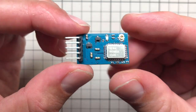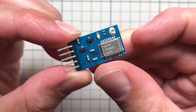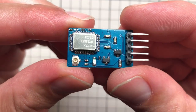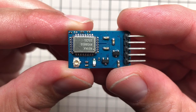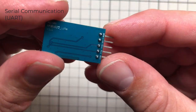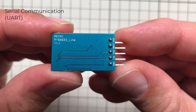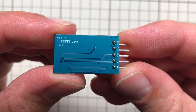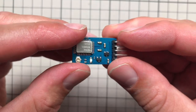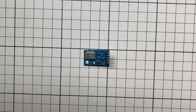Let's take a look at this GPS device, which is a tiny little board with a very small chip hidden behind this shielding. It has a few connections. There's the connection for the external antenna, which is highly recommended because otherwise you would have to have a direct visibility of this chip to the sky. The chip uses serial communication, which is handy because you can connect any kind of microcontroller to read the serial messages.